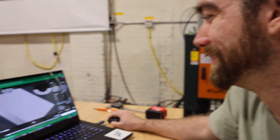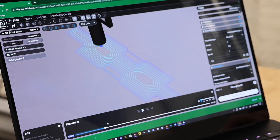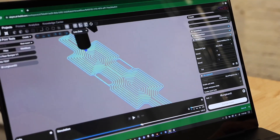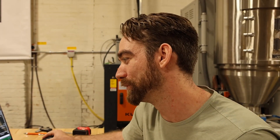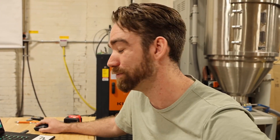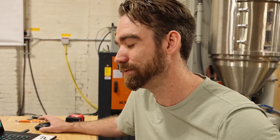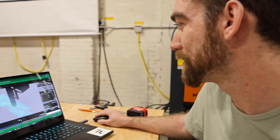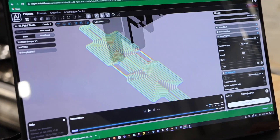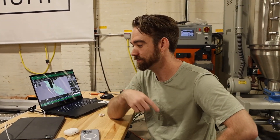We're gonna try to make a longboard. I'm choosing to have the tool paths go concentrically — I honestly have no idea if it will work. We're doing 10mm wide layers and 3mm height. My guess is it'll end up being a little less than 3mm, probably like 2.9. I'm going to adjust the extrusion parameter while it's printing if it needs to compensate.